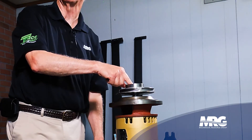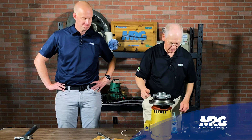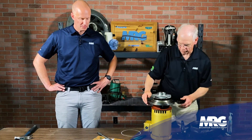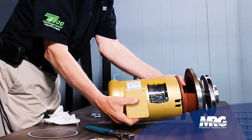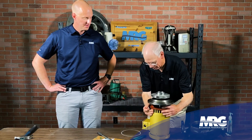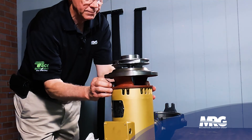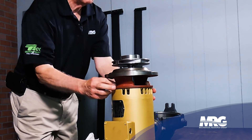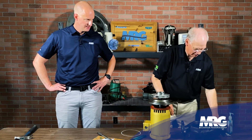The reason these pumps have a left-hand thread is that these pumps run backwards by design — so the impeller is only getting tighter as it runs. You flip it back over, and you need to put your bolts back in to secure the cover to the motor. Secure that cover back to the motor and it's ready to go — it's all in one piece. You can take it out in one piece and work on it on a table instead of having to work on it in place. The pump stays in place; you don't take it out of the pipe.